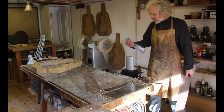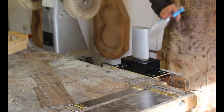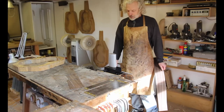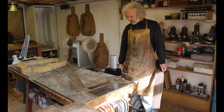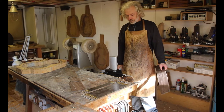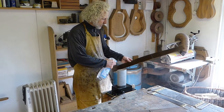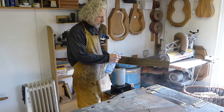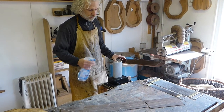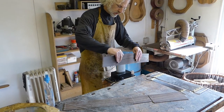I just use this spray, and as soon as the water is evaporating off from the bending iron it should be ready to use. I don't have a specific temperature I work at — it's more by feel and observation. All I do is quickly spray the wood itself like this. It's not really soaking it; it's just getting a little bit of moisture there so that there's a bit of steam to create.